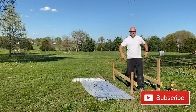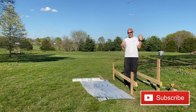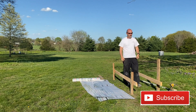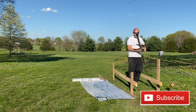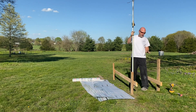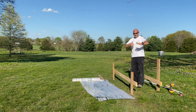The first thing we do is go around the whole perimeter of our foundation with stakes. I use wood stakes in this instance — easier to screw into, but if you're DIYing, metal stakes work too; you can sell them on Craigslist when you're done. Lumber is high right now so cutting up 2x4s into stakes seems silly. Once you run them, you take your laser — rent one from Home Depot if needed — and set these rails exactly on grade. With ICF footers specifically, plywood and metal forms on regular stem walls are a bit more forgiving since they can float over an uneven footer.